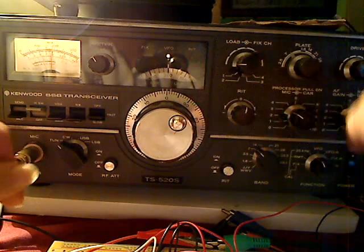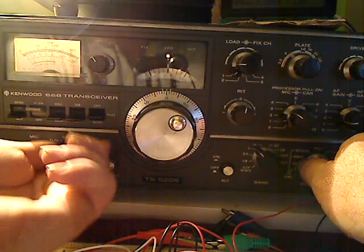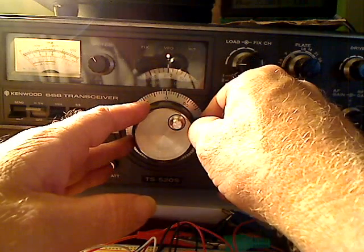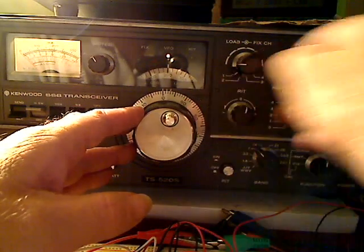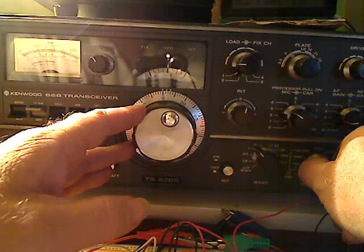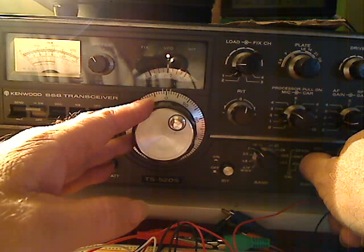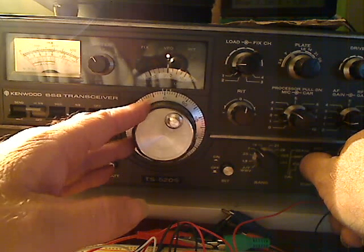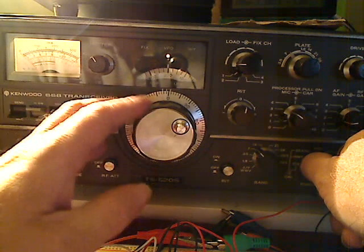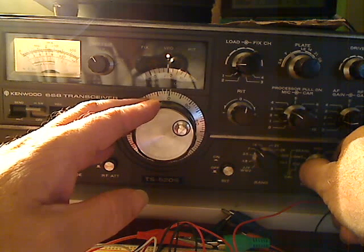Marker is still turned on — I'm going to turn my marker off. I'm going to go back to the lower sideband for a second and take my zero over to the lower sideband. Now I'm going to turn the marker back on. See right there? We're right on the marker. So if you calibrate with the tune position and go for the center one, it will calibrate both the upper and lower sidebands. As you can see here on upper sideband — same thing. There it is.